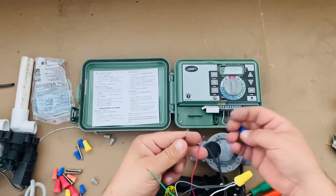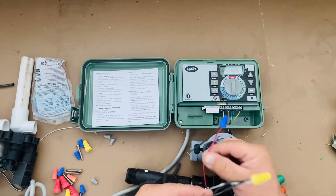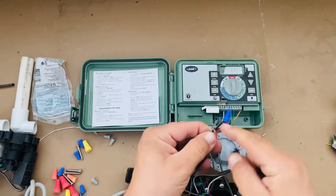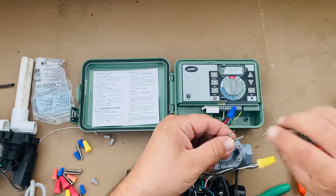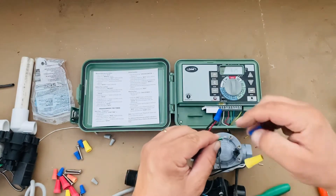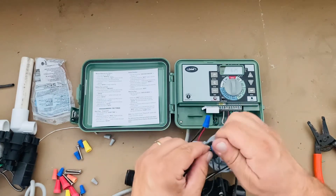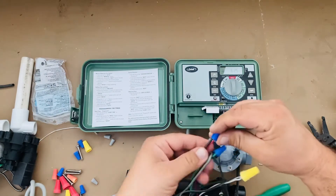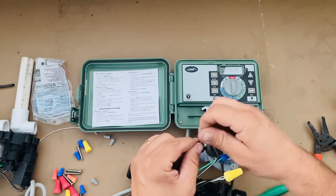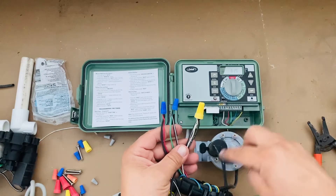Zone one is red — so I take zone one wire and connect it to this valve here, which I'm calling number one. That's why the red wire is there: red equals one, green equals two. Then I grab the other wire for zone two — as you can see it's too long, so I'll trim it a bit shorter. The strands have separated so I'll twist them together. You can wrap the wire around for a little more bite, but it's not required. I tighten until it starts twisting the wire — that way you know it's wrapped very tightly. So your common wire runs to both valves, red runs zone one, and green runs zone two.